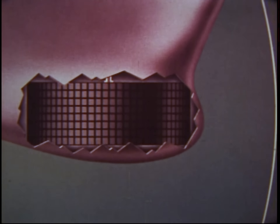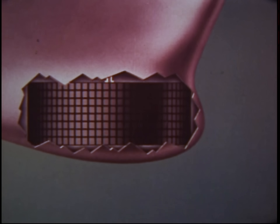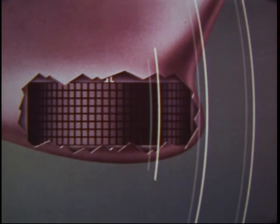The echo is converted from the underwater sound vibrations into electrical energy, which can then be amplified and processed by the sonar receiving system. Under optimum conditions, hull-mounted sonars work well over relatively long distances. However, these sonars are affected by underwater environmental factors, which sometimes limit their ability to detect targets at greater depths.